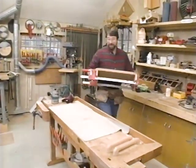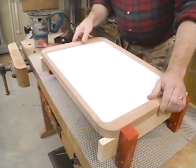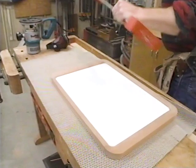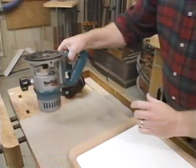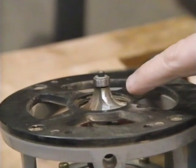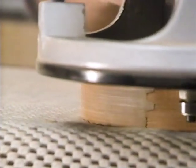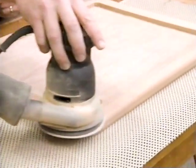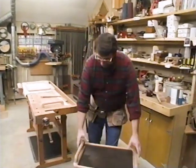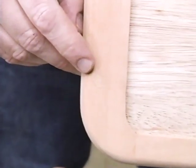After setting in the clamps overnight, the glue has dried and I can remove the tray. The first thing I want to do today is round over the top and bottom edges of the tray. I'm going to use my router again, which is still set up with the half inch radius round-over bit, except this time I've lowered the base of the router a bit so that I'm only using a portion of that bit. Now the handles for the tray are attached with some screws, and then the screw heads are covered with some mahogany plugs.